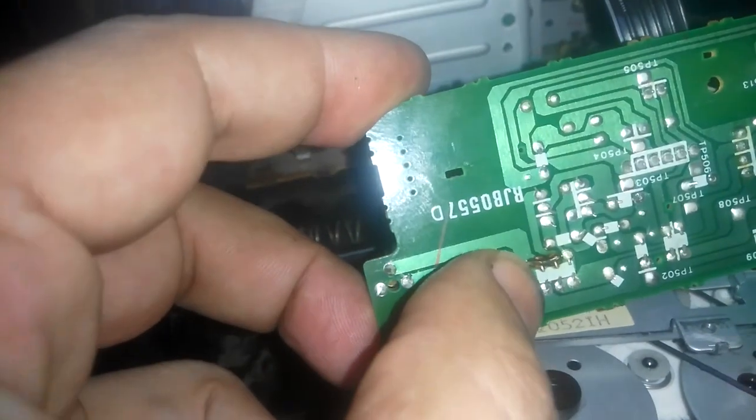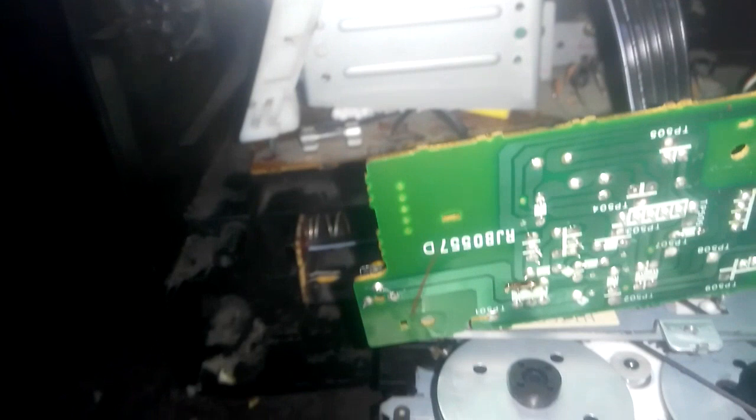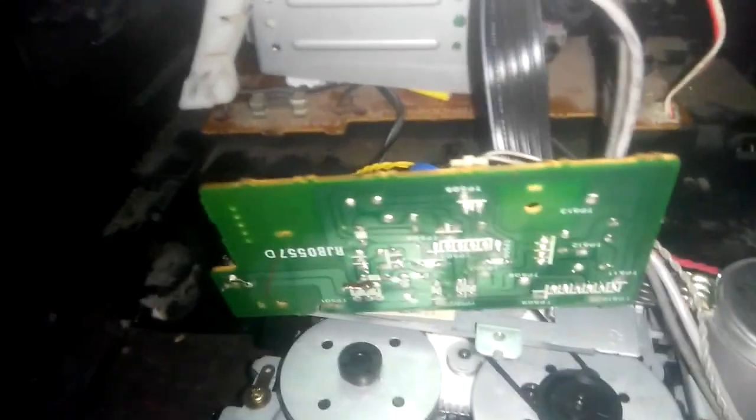I'm afraid this is supposed to be the slowest, but still it is very fast. So in order to make it slower, we can install a resistor - a resistor will resist the current going into the motor, thus reducing the speed. I'll remove one of these bridges and replace it with a resistor. This way I'll hinder the current and slow down the motor. I placed the resistor here and connected it with a neighboring bridge. Let's plug it in and see - now the speed is correct. Let's make it a little bit faster and see.